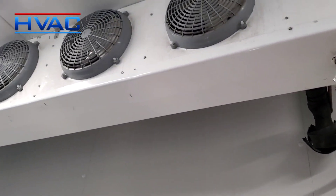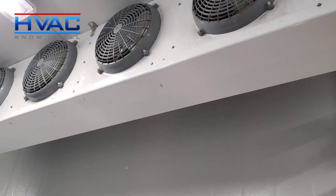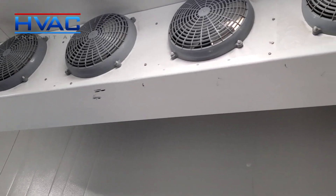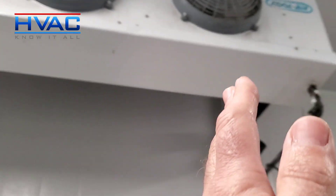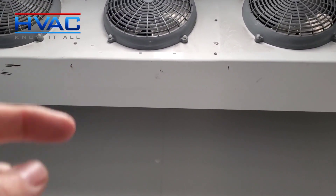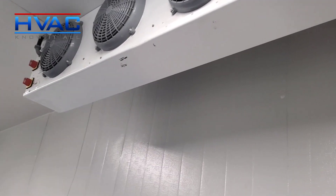We've also had the pan heater blow fuses intermittently. What I think is happening is this heater in the pan is not working correctly and we might have dams of water building in certain places, not allowing the ice to thaw out and flow to the drain. It's damming up, pooling, and overflowing. So if we're going to bring this pan down, we're going to have a new pan just in case there's some internal damage.